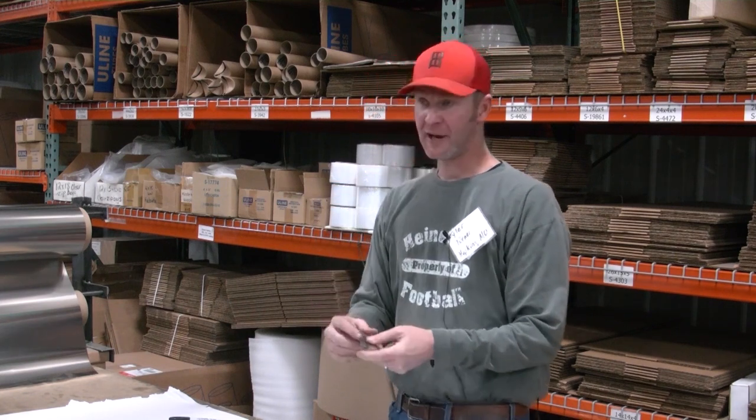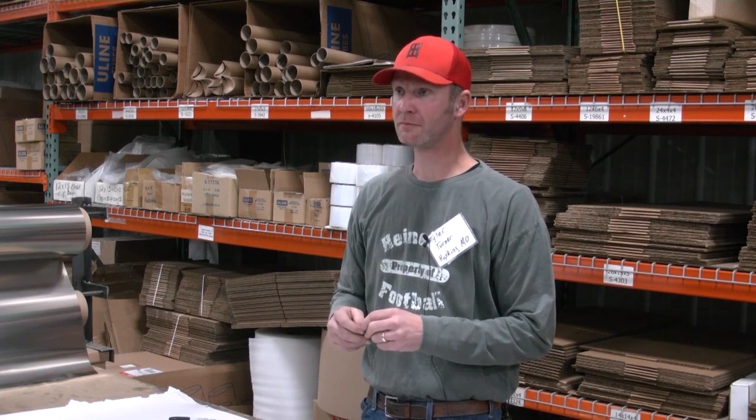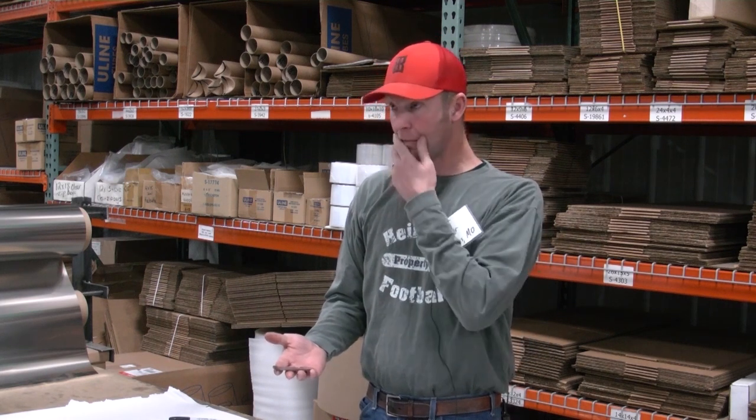But then, as far as work holding this stuff, find some work holding fixtures, just a 6x6 plate with holes drilled through it. You can find them off eBay or make your own. Saunders Machine Works has this great 6x8 fixture plate that's drilled for quarter 20 screws. On one side you can run quarter inch dowel pins in, and it's got partial thread engagement. The other side is full thread engagement. That's probably how I would put it, just with what I have.